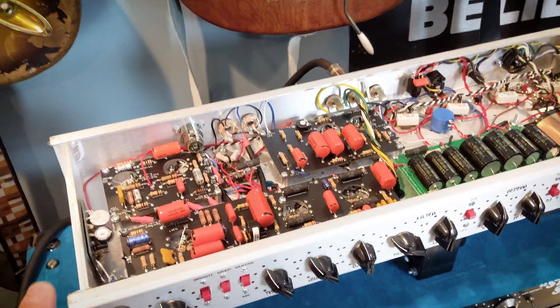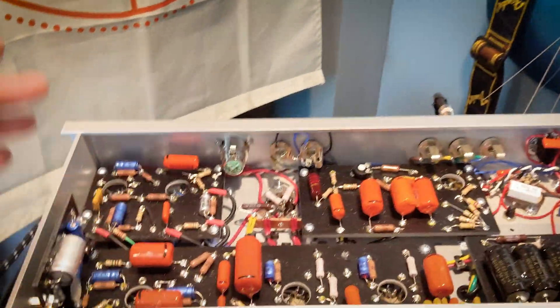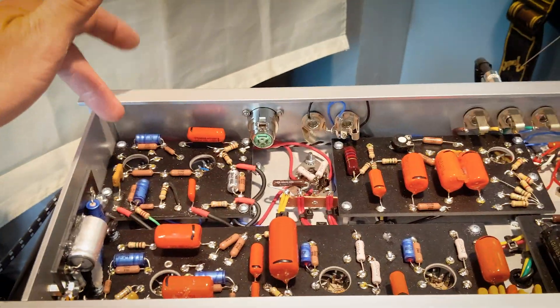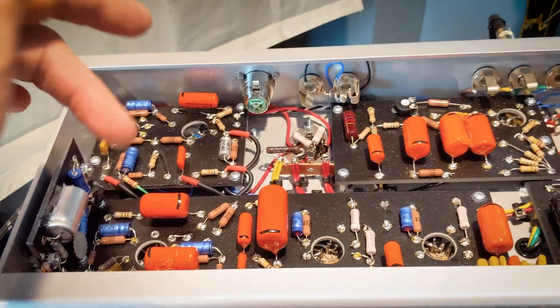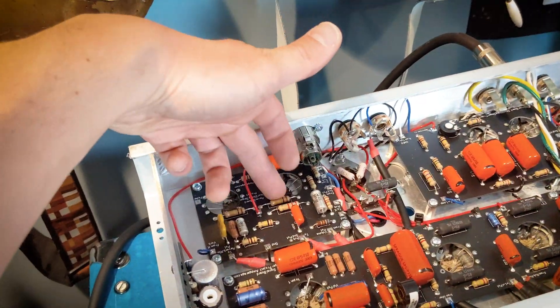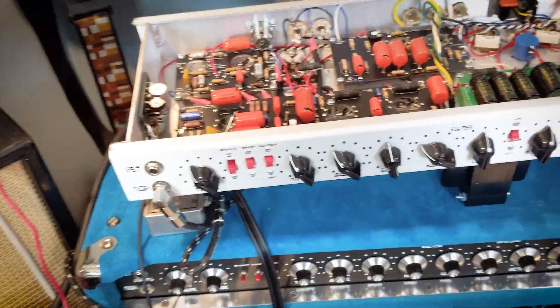I want to go over in this video some of the troubleshooting I had to do. I'm comparing with my main amp here — my Steel String Singer number two, my first point-to-point build — using all metal film resistors: plate load resistors, cathode resistors, all metal film. I went pretty much all out on modern techniques, but the purist in me and in the community said there's a difference in tone with plate load resistors if you go carbon film. Just stick with how Dumble did it and see what you think, and I decided to follow that advice.